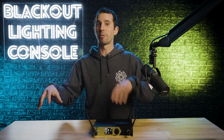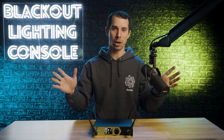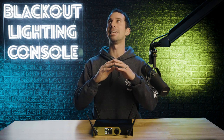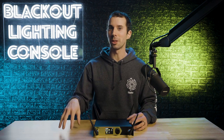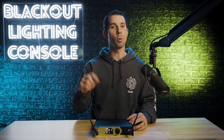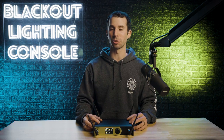Maybe now half of your Asteras have to go to another location that a splinter unit is going to shoot at the same time. And guess what? You don't have to worry about relinking them because that breakaway set of Asteras can automatically pair to that same linking key that is on the rigger's Stardust. Now that is something we have all been waiting for a long time, and it is awesome to see it in action. You can even spoof a Stardust with a Luna or Aurora, but it will only spoof the A antenna. So that can definitely be handy in certain situations.